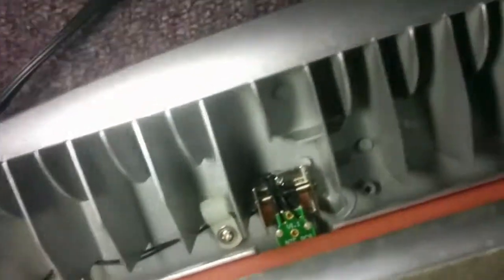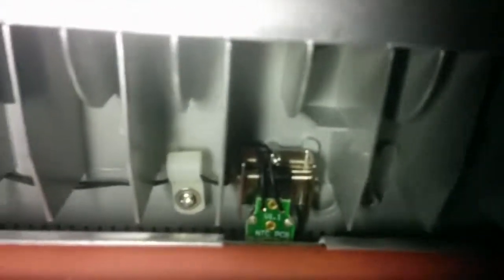Basically how it thinks it's at full temperature is the NTC thermistor gives a zero ohm reading or something similar. The issue was just an incorrectly installed NTC thermistor, which is really interesting. It was not a super difficult fix, but finding out that that was the problem took a little bit of time. But I learned a lot along the way.